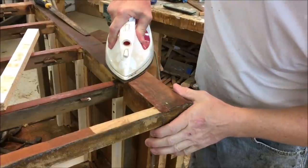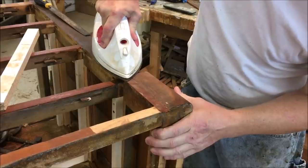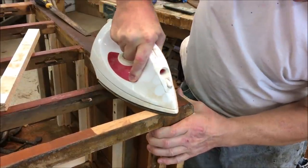I took the block off the next morning and the edge curled up just a little bit. So I'm going to take the hot iron and just press it down. It'll reheat the glue and press the veneer into place.